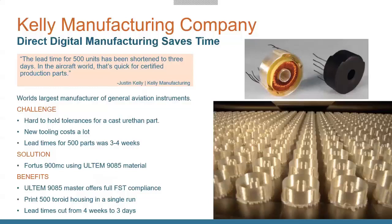The advantages they saw with the F900 were that the material was strong enough for end-use production parts, and they could print all 500 parts in a single run and have them ready the next day — or within a couple of days. That cut their production time from waiting four weeks to printing them all in one go. The parts had better tolerances than the urethane castings, so no hand-sanding was needed afterward. In the end, they saved about 5% per part on cost, but the roughly 90% time savings was the huge advantage — no more relying on third-party operators with potential manufacturing, shipping, or weather delays.